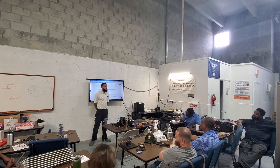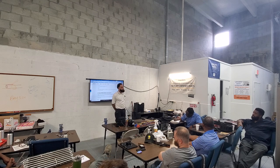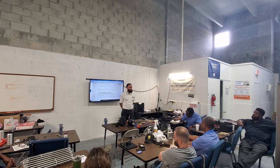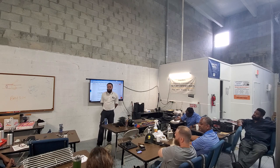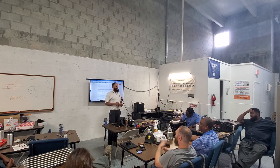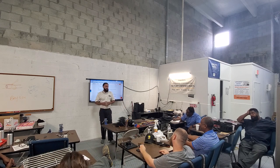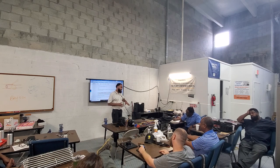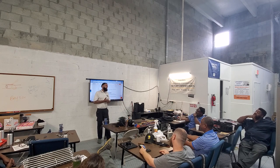Now, inefficient compressor. Step one, what are we doing? I think you would be trying to evacuate at that point. What's that called? Starts with an R. Recovery? Yes, sir. This is if you already got the new one with you. Assuming you gave them the estimate, you got approval to do the work and you have the parts. This is where you say, this trip is going to pay itself off now. This is my first time to pay that loan back.